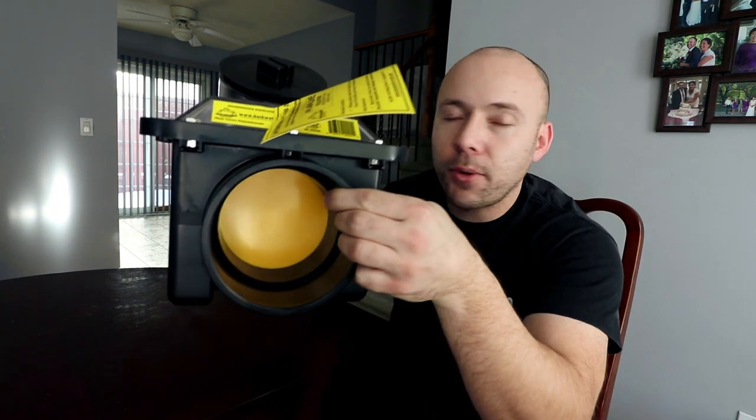So peeps, a backwater valve is a valve that has one direction of flow. Now the whole intention of this is to put this on the main line going out to the sewer outside. And the reason why you put this on the main line is because this is a normally open valve. But I wanna show you what happens when water starts to flow in the reverse direction than it is normally intended. So inside this valve is a little trap door essentially.